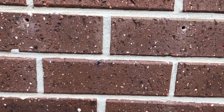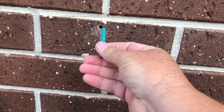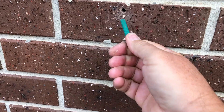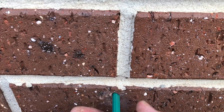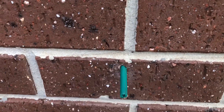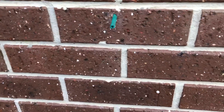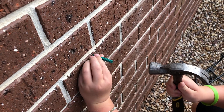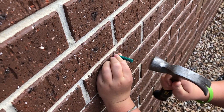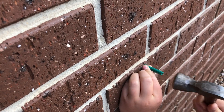The next stage is to get a green plug — something like this. They press into the wall. This one's a big long one, longer than I want. I'm going to push it in to the depth of the screw, then chop it off and use the off-cut in the other hole as well. Just hammer it in — hold it square and keep going until it comes to a stop.